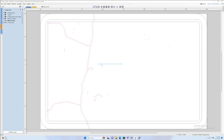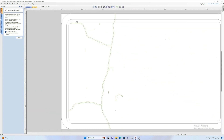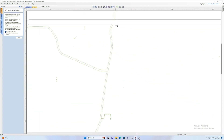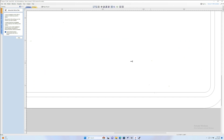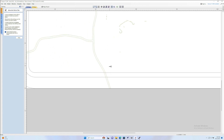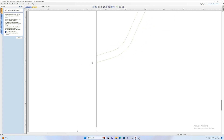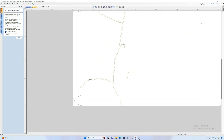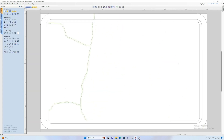Since these vectors are in a group, the first thing I'm going to do is right-click them, click Ungroup Objects, and ungroup back onto the object layer — that way it'll keep them on the same layer but ungroup them so we can work with them. I'll click back over to the Drawing tab and find the Scissor tool. The Scissor tool lets you snip all of these vectors to the edge of our little drain channel, because we don't want the laser to burn past that drain channel. It's pretty easy to do when you've got clean vectors like this.